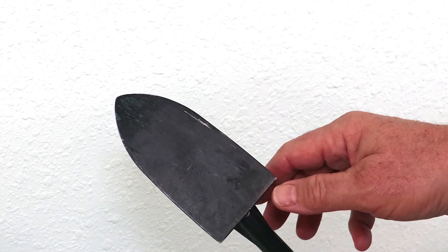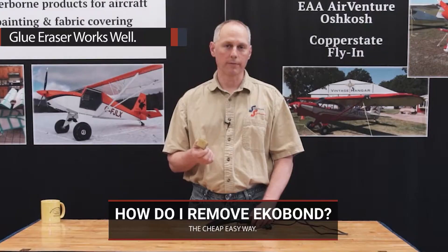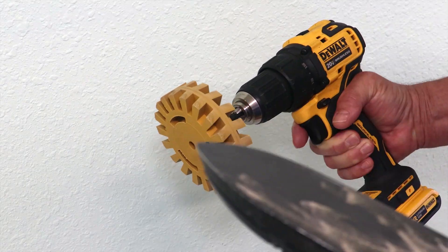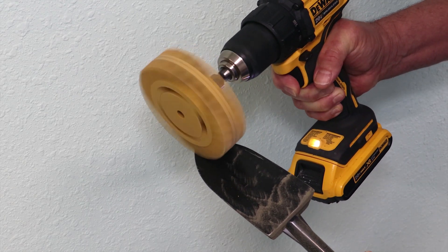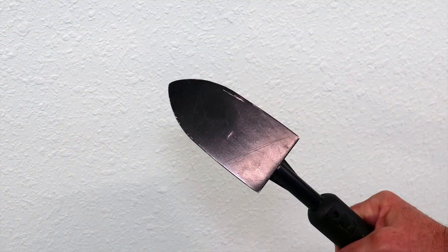Very often, when the Ecobond glue isn't completely dry yet, the soft glue builds up on the irons. I found this neat little trick to remove the glue. Stewart Systems recommends using a sanding belt cleaning stick as a glue eraser — I tried it, it's tedious, and takes a lot of effort to completely remove the glue buildup. They also recommended using an adhesive decal remover in a drill for any large surface. I bought one of these on a whim a long time ago from Aircraft Spruce, and man, does it do the trick! In no time, that iron is clean again and ready to go. This really saves a lot of time and keeps the glue from balling up when ironing a patch.